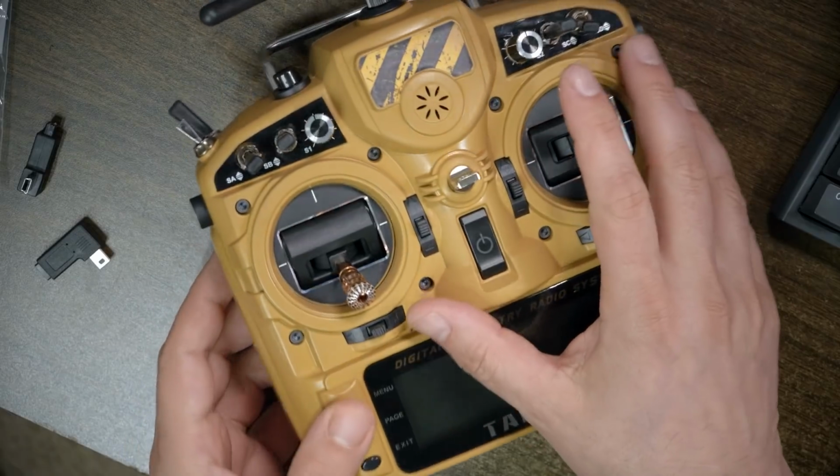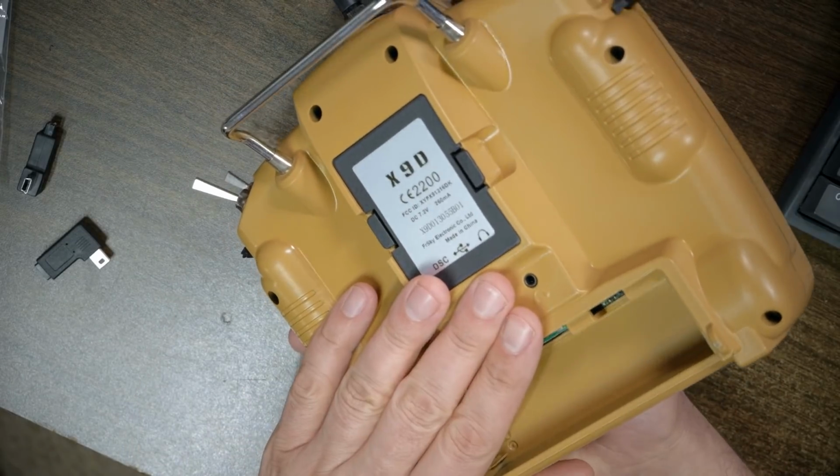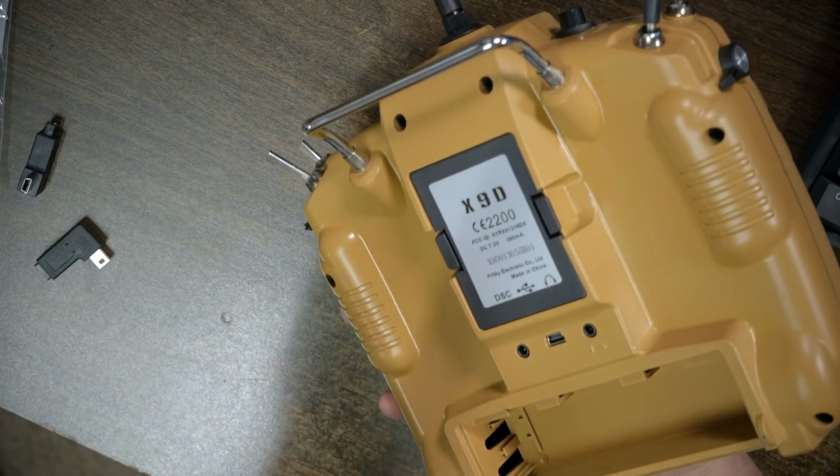But when you put it into DFU bootloader mode, whether that's a flight controller by holding down the bootloader button or on this type of radio by just plugging in with the power off, that is not something you as an end user can screw up, unless you just take a soldering iron and jam it into the board and damage the board. The DFU bootloader is baked into the chip and is the sort of ultimate fallback to let you fix it if you flash the wrong firmware to the radio or something.